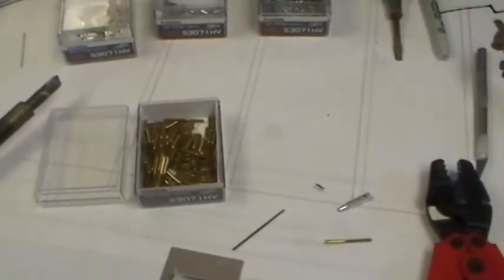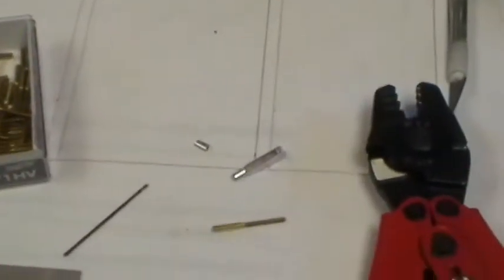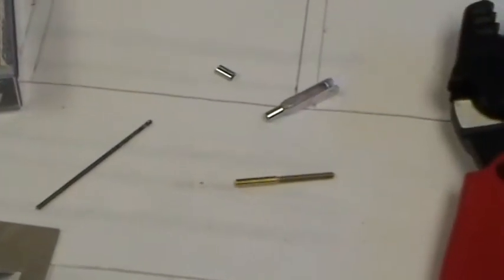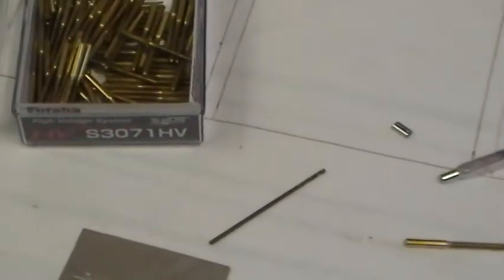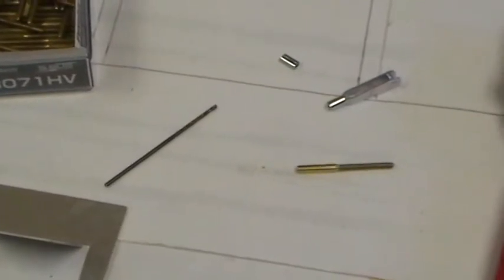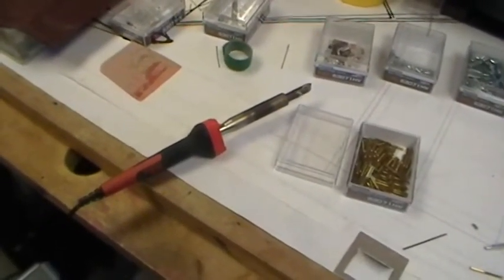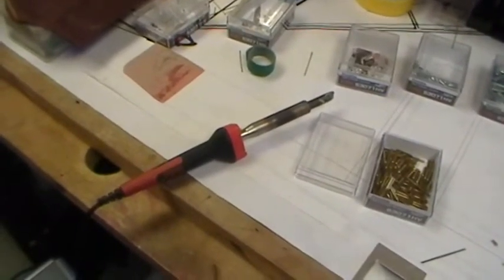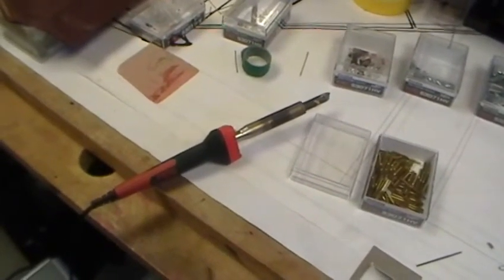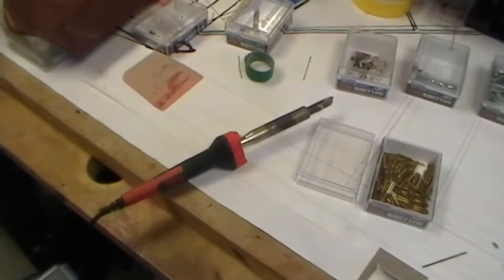Then you've got the brass ends, which you use to solder the end of the cable into — they have a clevis and a nut, and the other end is the swage. They're pretty small, so you're going to have to use the ends of your fingers quite regularly. I use a small 30-thousandths drill bit to scratch up the inside of the tube before I solder it, which gives it a little better mechanical bond, a little better bite into the brass threaded end. I use an 80-watt soldering iron. You can use probably anything from 60 watts on up, but the 80-watt has a tendency to get the solder to flow quicker, gets it good and solid, and doesn't take as much temper out of the brass fittings. Because the hotter you get them and the longer they stay hot, you end up annealing them, they get soft, and it bungles up the threads. What you want to do is get it soldered quick and get it cooled before you get too much anneal on the brass parts.